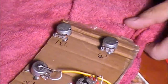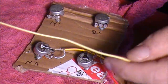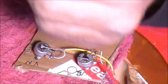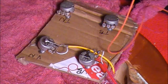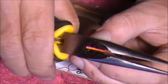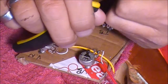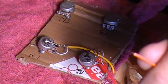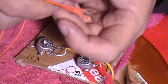So what we do is we need to grab another length of wire - we've got these long wires here. It doesn't matter which colour, there's a red and a yellow one there. I've got the red one now. We just need to expose about five millimetres at both ends so we've got something to solder onto. Just with your pliers, be very careful not to actually take the wire out - you just want to take the plastic coating off.